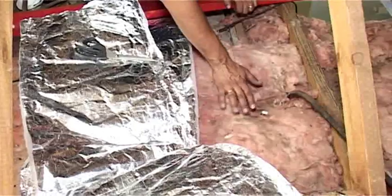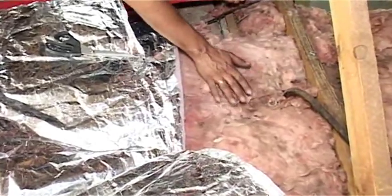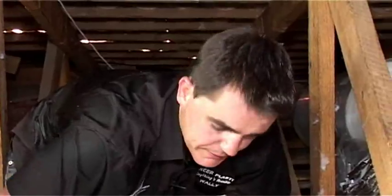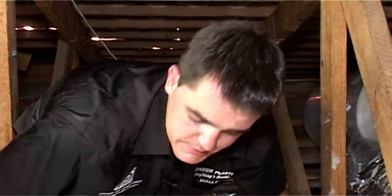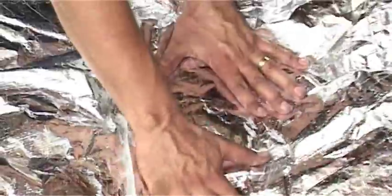Many times you find that after four or five years, the product becomes so saturated with dust, moisture, and air that it actually starts collapsing and has very little thermal value. So although there's insulation in the roof, it doesn't mean much in terms of thermal efficiency. That's why customers want a superior foil product — the benefit being that the fiber is protected by the foil facing, which protects it from any moisture and dust.